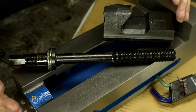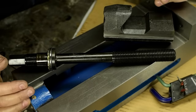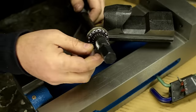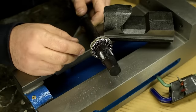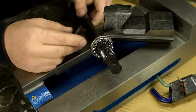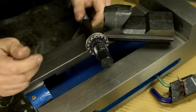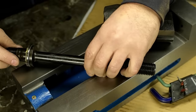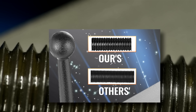Took the nut and the screw out. Mixed feelings here, but nothing I'm going to complain about given the price. Was pleasantly surprised to find a bearing in here, a thrust bearing. I for sure was expecting, like, bushings, bronze thrust washer maybe. Not the best bearing in the world, but, you know, it's a bearing. The screw threads look clean. They're regular 60-degree coarse threads. The ad led me to expect Acme or trapezoid threads because, you know, it says it in the ad.